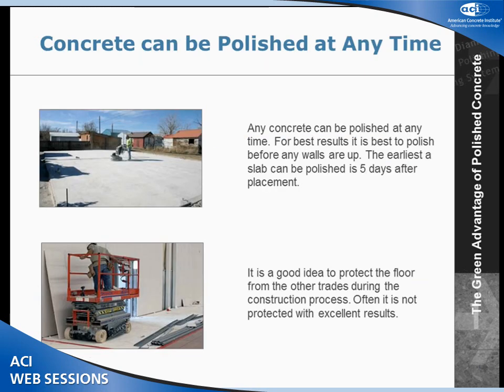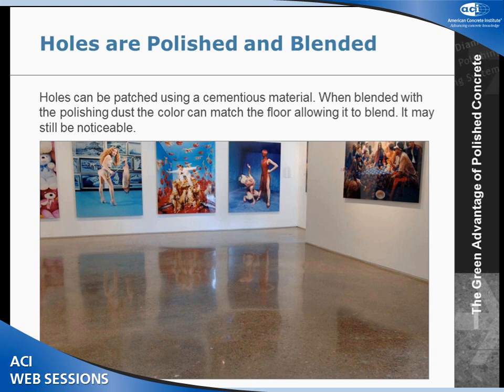The question is when to come in during the construction process. We can actually come in as early as five days after the concrete has been placed. We've been told 28 days is the golden rule, but we started doing it earlier and earlier. In five to seven days is really the earliest we come in — at four days it's still a little green. We did a whole subdivision in Austin where they poured concrete and five days later we were in there polishing and grinding. We do recommend that the concrete be protected after we polish it — there's cardboard or a new peelable liquid product.